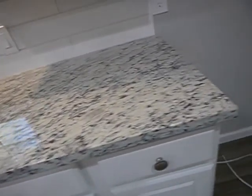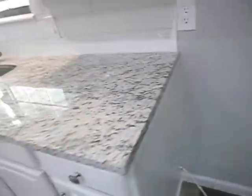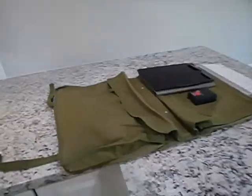You're also supposed to have a dedicated receptacle outlet for the refrigerator — not the circuit but the receptacle. This cabinet does not have an electric receptacle on the right side. If your countertop landing pad is wider than 12 inches, you're supposed to have an electric receptacle outlet. You have one over here on the left, but you don't have one over here on the right. If you put the refrigerator here you're going to be going behind it, and it's not supposed to share with the refrigerator.